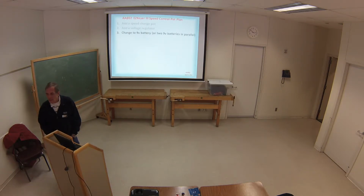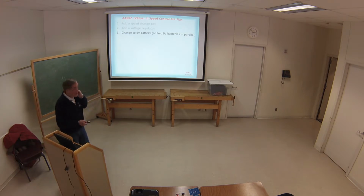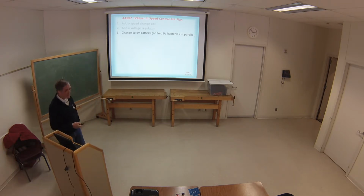Yes. Do you look at a rotary encoder for that function also? No, I don't want to do that yet, because then you don't know where you are. With this I can turn it on and I know where I am. A rotary encoder, you wouldn't. It's all relative then. Okay. But I'm going to hook it up with 2 sets of batteries if you want, and they're all in parallel, not in series, so you get added battery life without having to open the case up. One battery or 2 batteries, either one, you can take your choice and hook them up. And it works out nicely.